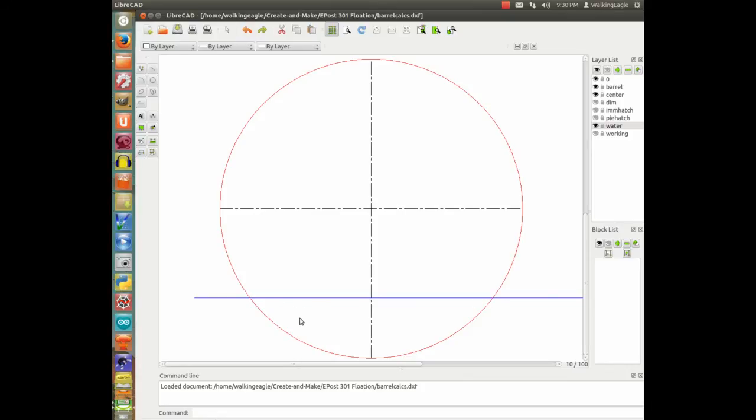We're not going to deal with that tonight, but as you can see, we would have a pretty good little problem to figure out. Once we get up to halfway, and then we start immersing it a little bit more, the displacement decreases per unit of immersion. So again, we have that same problem. Now, if it's completely immersed, we can easily figure out the volume that's going to be displaced with the complete circle. And half of that we can also easily figure out, because it's exactly a half. So we're going to do the two easy calculations tonight. And in the next video we'll start dealing with the more complicated calculations, and at that point we'll be using all that trigonometry that we just talked about. So there was a reason for dragging you through all that muck.